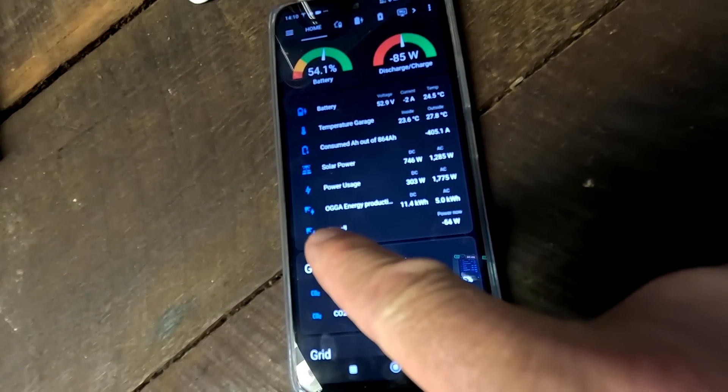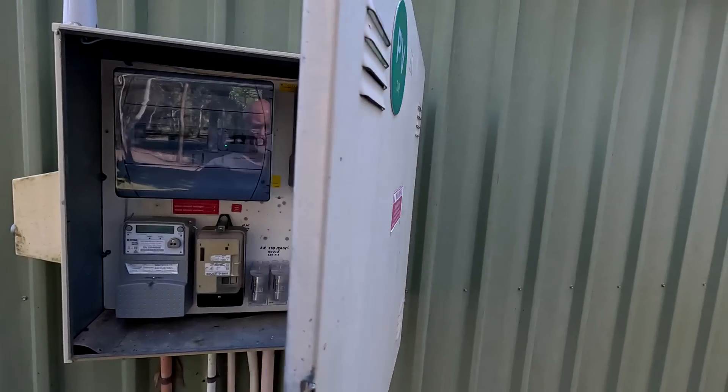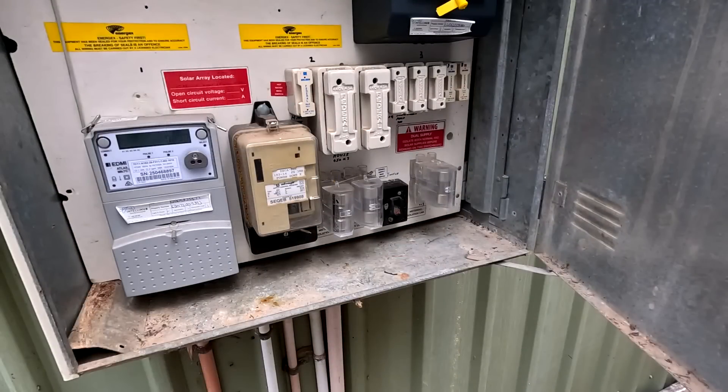I made a Home Assistant entity called 'overall' which adds up power from the off-grid system, on-grid system, and the grid itself — battery, grid, solar panels — all combined. In the last 3-4 months I've never seen it peak over 8 kilowatts, so a 50-amp 12-kilowatt supply to the house is plenty. We now have three different electrical systems on the property, which is crazy. The old meter box still had ceramic fuses, which I always wanted to replace with normal circuit breakers.